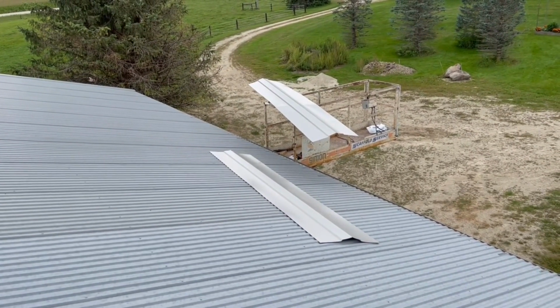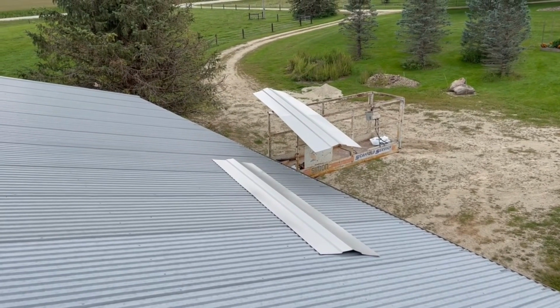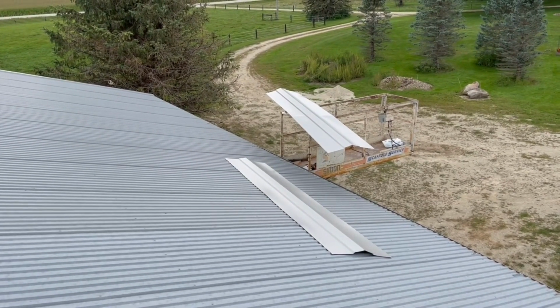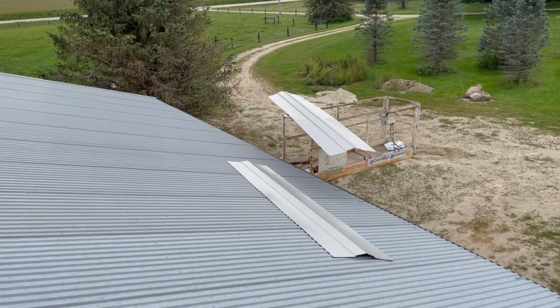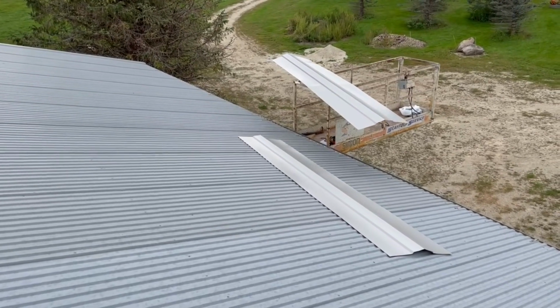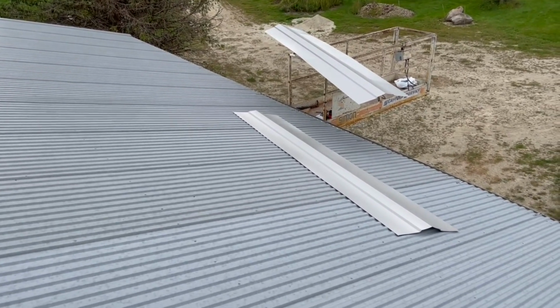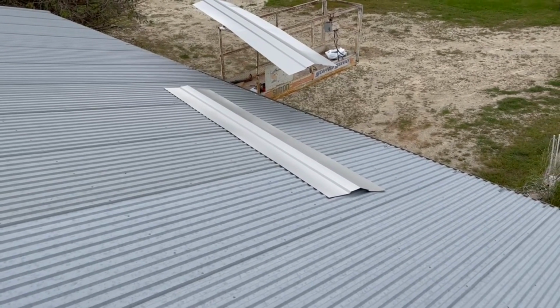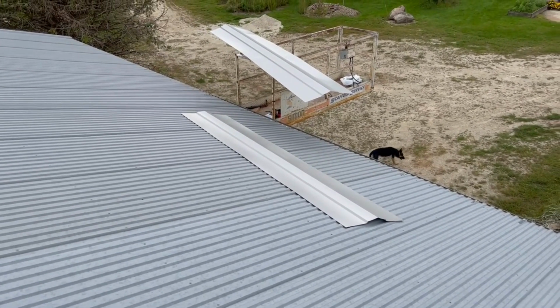If you've got a scissor lift, boy, it sure makes the job easier. Come right up here to the roof. It's, was that a 12-foot door, probably 14 to the gutter, and then on up. So not hard walking, and I've got a ladder set up as a backup just in case. But there's that material you see there. I'm all bent, ridge cap, 26 inches, ready to get installed.